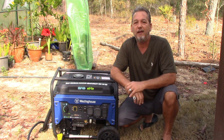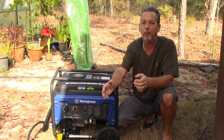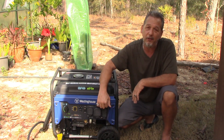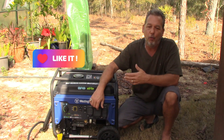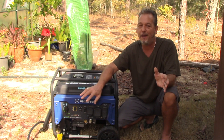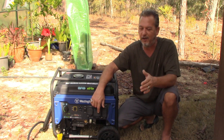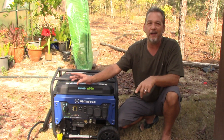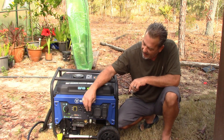To power up the panel in your house and run everything inside, you have to have both legs, because when I showed you guys the panel, there are those two thick wires coming in — one powers up one part, one powers up the other part, and whatever needs 240 is connected to both parts, L1 and L2. So if you have a TV here and a light over there and they happen to be on two different legs, if you only power one leg, your light might work but your TV has no power, or vice versa. You have to have both legs, L1 and L2, connected to your home in order for this to work. That is the difference.